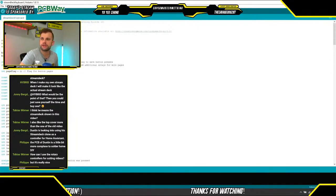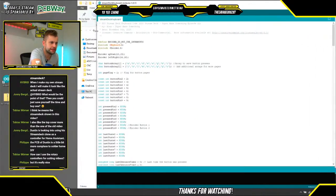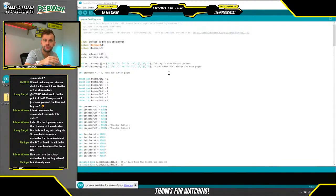One thing that I did here is I did not use interrupts, which is usually what you want to do with an encoder. Again, that's just due to the button layout. An interrupt, as its name suggests, basically interrupts any code that's currently running on the microcontroller when you move the encoder left or right. That's done because an encoder has to be read extremely fast when you click it left or right, because it counts how many times the little reader inside moved left or moved right.